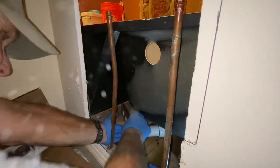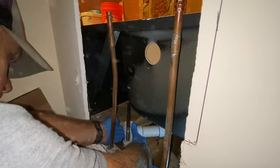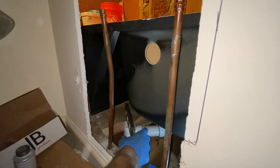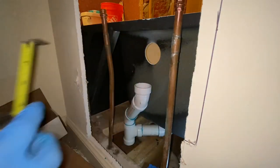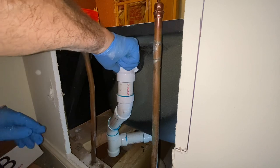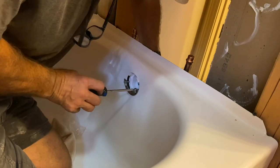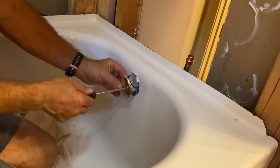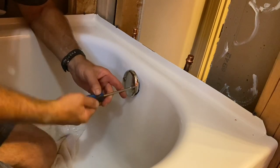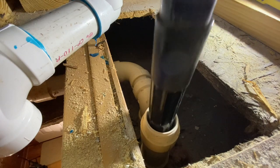The next thing we're going to do is build a little offset to the top of the overflow hole. One of the main things you want to do right here is make sure you're precisely under the hole from center to center, and that your offset is the perfect distance off the back of the tub so that little black gasket sits perfectly. When you go to screw things down from the front, you don't want a gap behind there. With everything in place, all we need to do is throw our cover plate on and get ready to trap this thing.